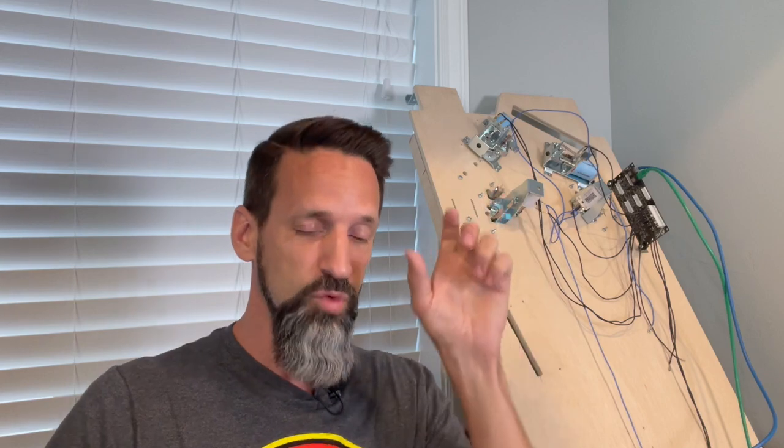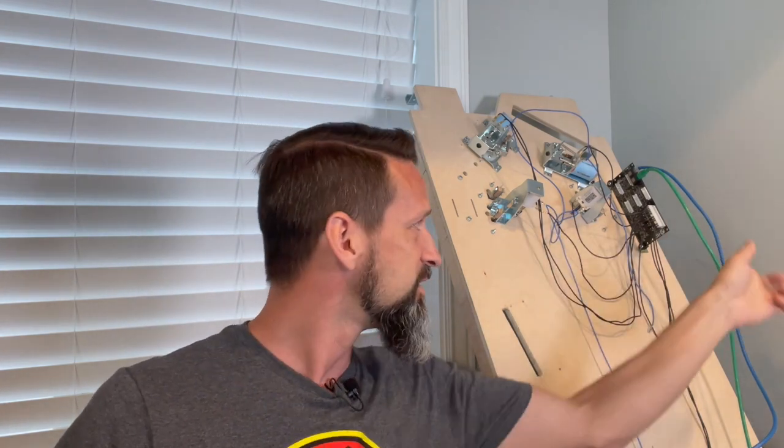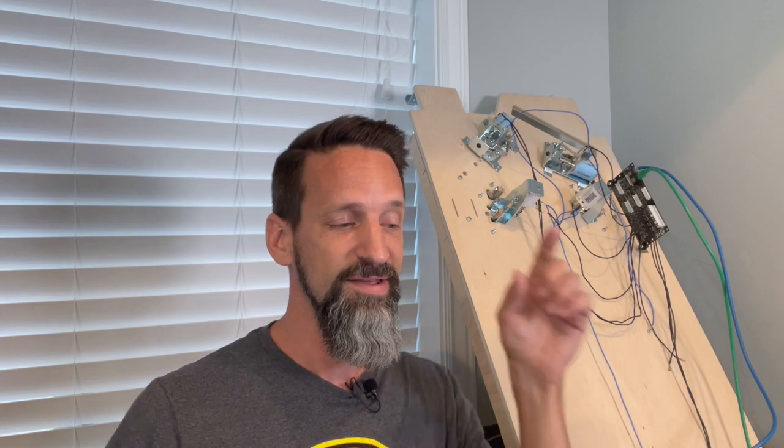That's when you want to work on your config file. The MPF installation tutorial does a good job of walking you through it, giving you examples and explaining how your config file needs to be created. So feel free to do your own from scratch. Or if you've been following along and wiring things to all the same terminals that I've been using, feel free to grab the file from my tutorial and dump it into yours. I've got everything written out in there for the coils, the switches, everything. Follow along on that tutorial, get the file put into the right directory on your computer, and then start up MPF. And once we start up MPF, we should then be able to see this.